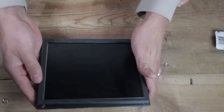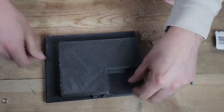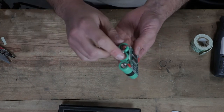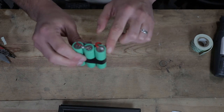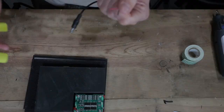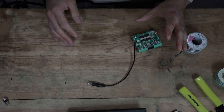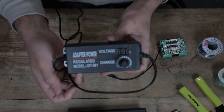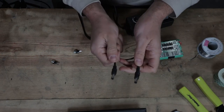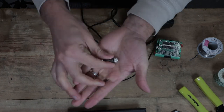So that is essentially the body of this monitor — we just printed our own case and it has all of these nice new internals. Now let's get this battery situation figured out, because there's a good spot right here for the battery. I made this 12-volt battery a couple videos ago. What I did was make a spot welder for nickel strips to make battery packs, welded the battery together as a test, then soldered on a battery management circuit for charging and balancing the cells. So I'm going to take this barrel connector and hook it up as a connection point for this battery for both charging and using it.